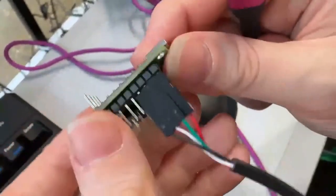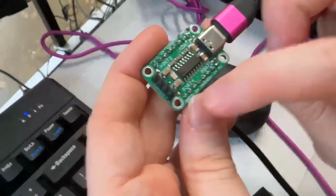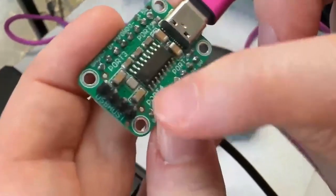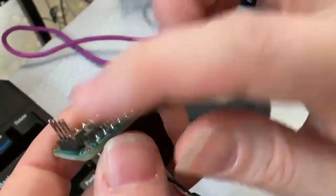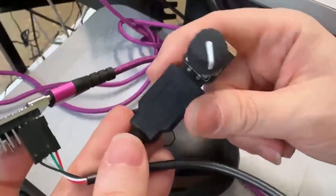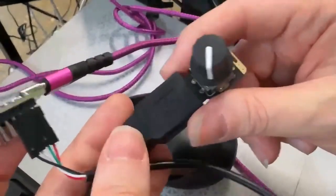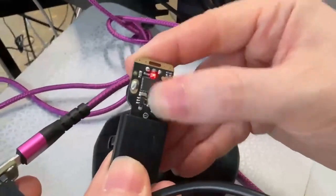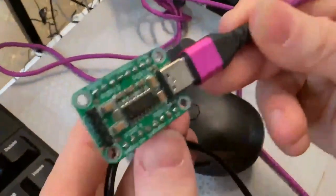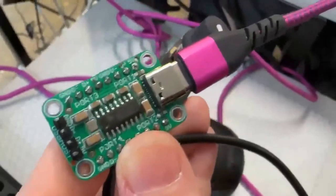This is a prototype of a DIY USB hub. I soldered a header onto it because I want to test it out. It's a four-port hub, so when you plug in USB on this side, it gives you four ports — power, data plus, data minus, ground — four times: one, two, three, four. On the other side I've got a USB breakout cable, just a port to header with no USB chip inside, and a Trinket to test it out. When I double-click, green means it enumerated, and on my computer it shows up as a disk drive. All four ports work. This is going in the shop soon — it's an SL2.1A, a USB to four-port hub.